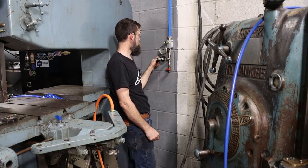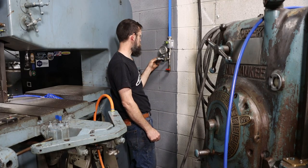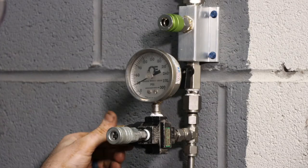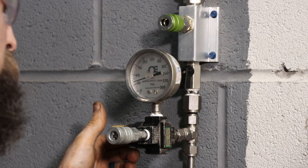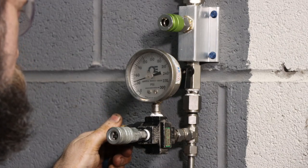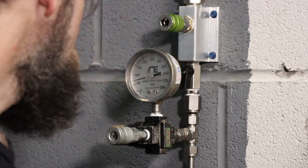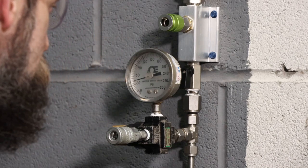That was uneventful. And wind up this pressure regulator to 35-40 PSI. So I don't want line pressure, obviously, going to this saw. It really was not designed for that. So let's go there, and we'll try that, see how that works.